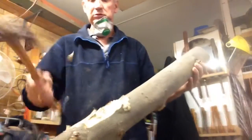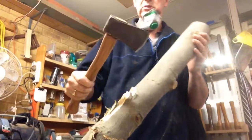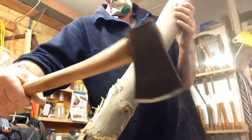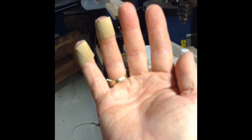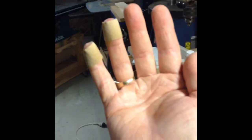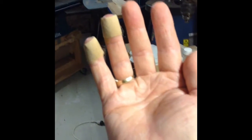Here's the proof in the pudding — does it cut? Well, it seems to. And with my record with sharp things, it's probably better it's not too sharp. The end product is a bit rough, but I think it'll do the job. You'll remember I said early in the video about making a blunder when sharpening the axe head — well, this is the reason why: if you're doing this yourself, leave the sharpening until after you've fitted the axe head.